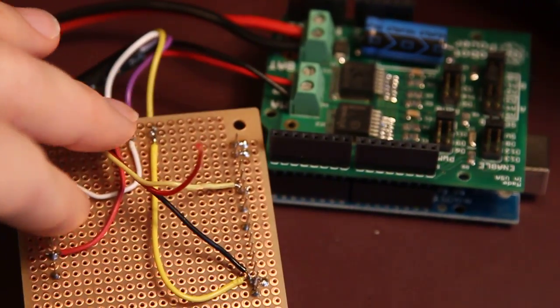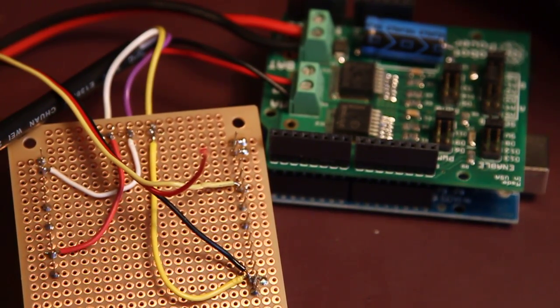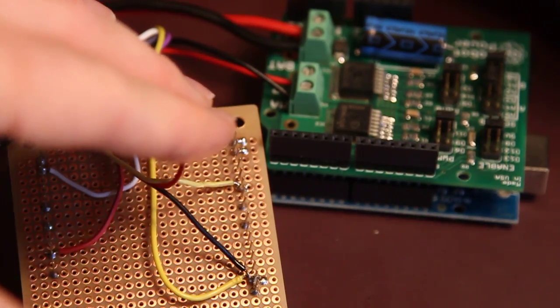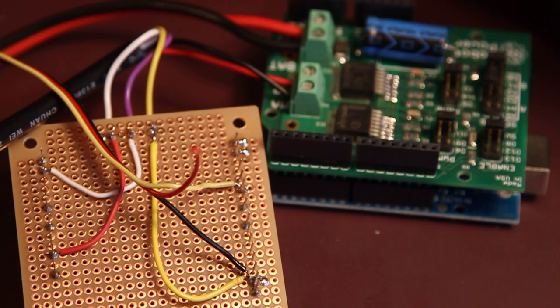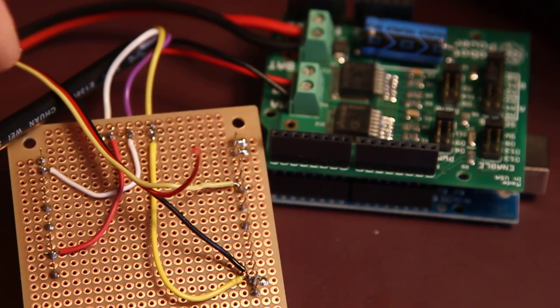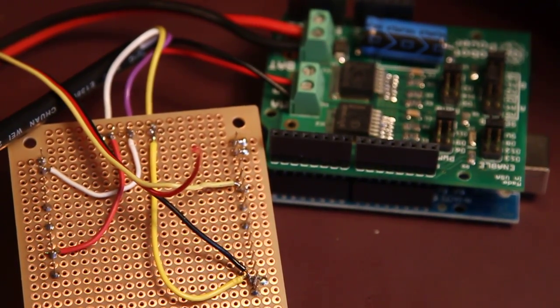What is connected is a signal wire, and that goes into PWM5 on the Arduino — not Analog 5. That's important because the code is measuring pulse-in on pin 5, which is a PWM pin, not an analog pin. Then there's a ground, so we've got two voltages on the same ground: Arduino at five volts and the receiver at six volts.